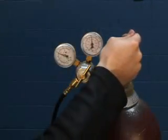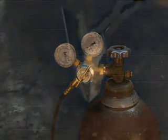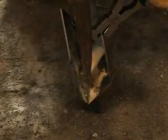Since shielding gas is not required, you should turn off the gas. You may also opt to remove the nozzle. If your voltage is set too high, it will be difficult to remove the slag. When set correctly, you should easily brush the slag from the weld.